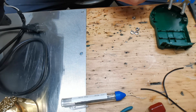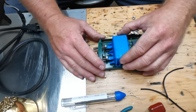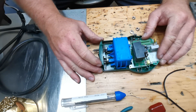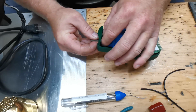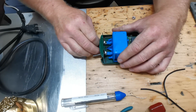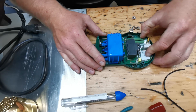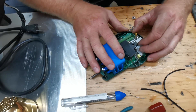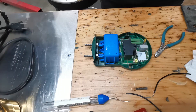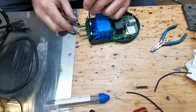Get in there. Doing this out of view here. Get over the top of that bar. There we go. Don't bend the pins. There's little pins that the circuit board goes on and it doesn't exactly fit super well. These happen to be 10 millimeter, so I'll be holding them on this end and tightening on this end.